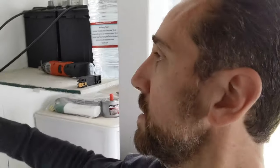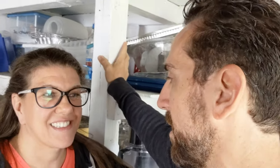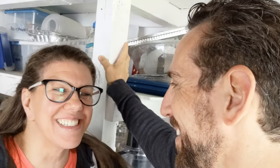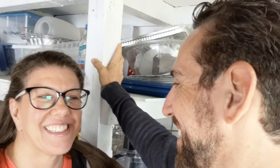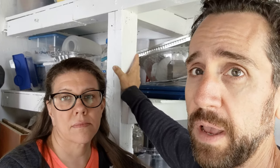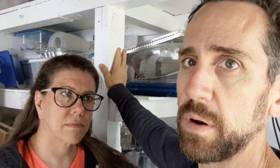The other thing back here are the batteries. We have two 12-volt batteries running in series — in series you add voltage, so that's 24 volts. It's important to know your battery voltage for your inverter and MPPT, because you'll have to program or set that. Some come set up as 12-volt, 24-volt, or 48-volt. Both of ours are configurable, so you want to know that when you're configuring them.